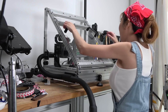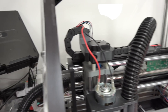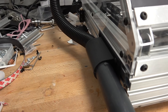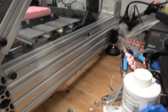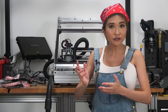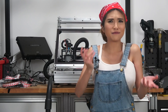I've got the dust removal holes going around the back and a 3D printed port on the side. Below that is the hole for the control and power wires. The hole goes to a 3D printed adapter on the side that fits the handle to my vacuum. I decided to use three rubber feet so I don't have to worry about leveling it — most of the CNC machine's weight is in the back anyway. The magnetic cover worked really well. I think I will use that design in the future — it leaves lots of room to access the CNC machine and I don't have to fiddle about with designing finicky hinges and latches.